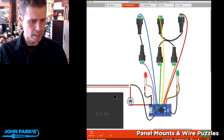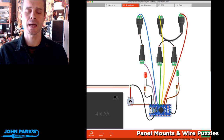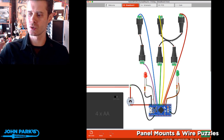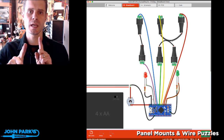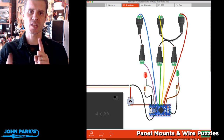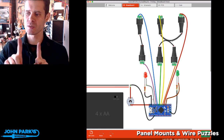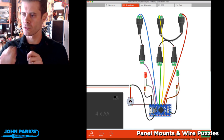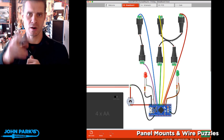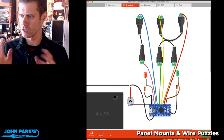And I found a guy on YouTube, and I'm going to forget his name now, but I'll look it up later, who had built a really great project for this and came up with a very nice solution to having the pins on the Arduino alternating between being input with a pull-up resistor, so input pull-up, versus output, so they can sort of run around the pairs that are possible and see who's connected without causing any problems. So it's possible to change whether a pin is input or output midstream. And so this is very clever. It just toggles through them in pairs to see when things are connected properly. And I'm sorry, I can't remember his name now. He's a great YouTube channel.